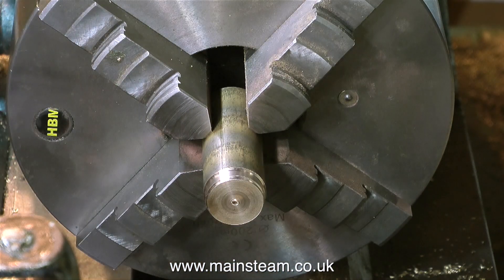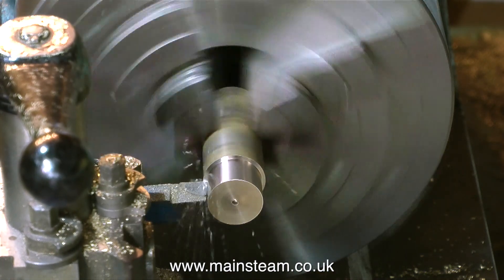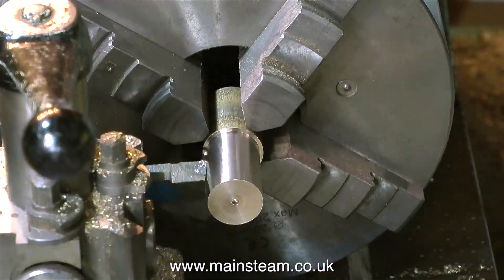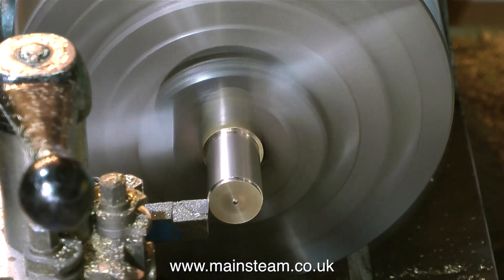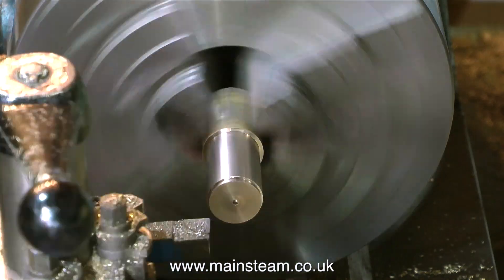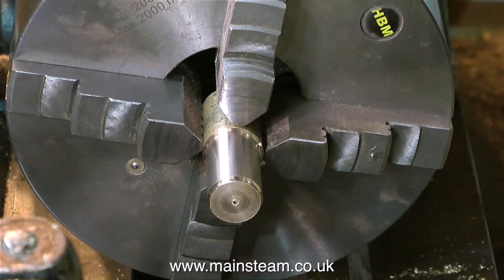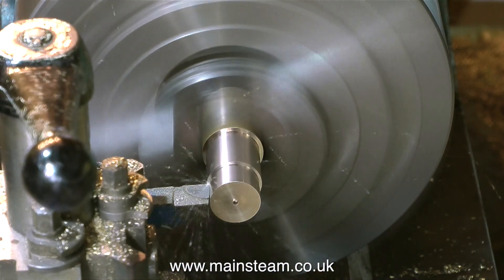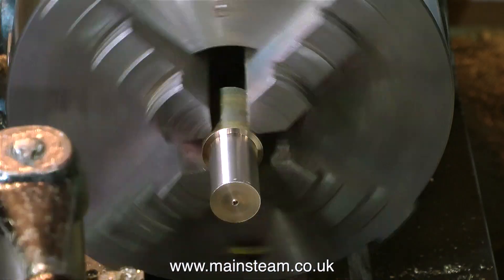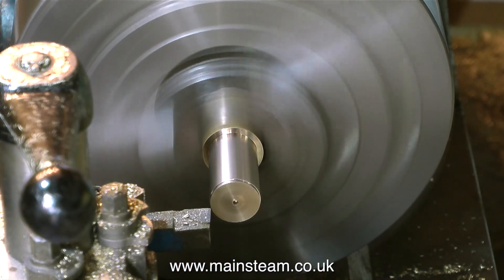I've fastened both halves of the bearing together with a couple of cable ties and I keep trying the original bearings on the piece that I'm machining. By testing the size before every pass I can get a very accurate fit, and once I get the part quite close to the size I need I frequently test it with the bearing. I will only take a cut along the full length of the work once I make sure that it isn't too small. It's quite important that the lathe you use is accurate - some lathes will turn tapers and that's no good at all.